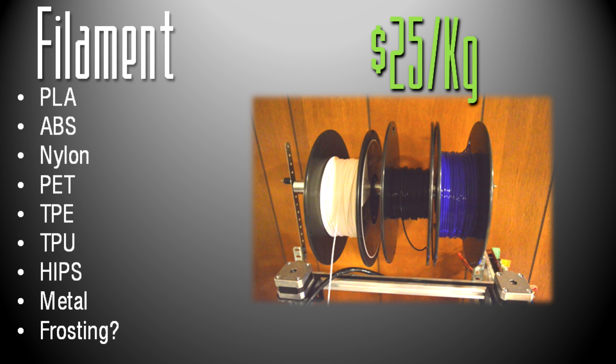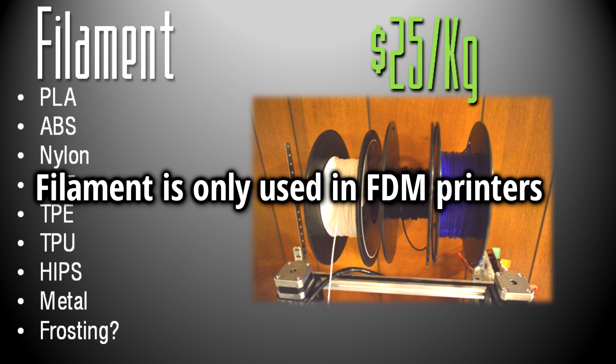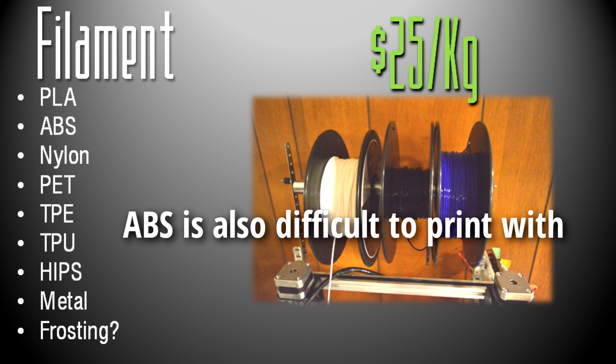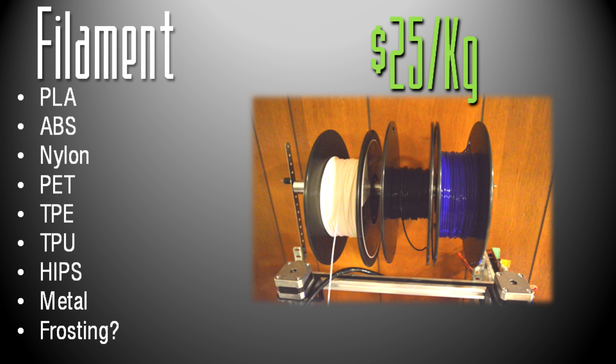With the history out of the way, let's talk about what 3D prints are actually made of. You can see all these different acronyms: PLA, ABS, Nylon — well, Nylon's not an acronym. There are a variety of materials 3D printers can use. Primarily for FDM printers like RepRaps, MakerBots, Ultimakers, and my printer, I use PLA, which is polylactic acid — it's a plastic. It's rather cheap, only $25 per kilogram, and a kilogram is one of those huge rolls. ABS is the second most popular, with a higher melting point but better mechanical characteristics. Nylon is even better, but I won't get into detail with those because I don't have experience with them.